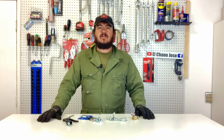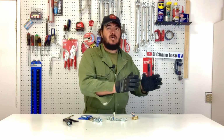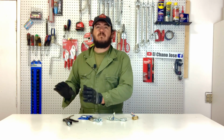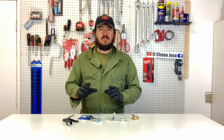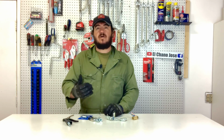And well, folks, we wanted to expose these simple tips that can make a difference when you're buying tools for your garage or for your shop, because if you keep them all automotive or all industrial, that can make a big difference. That way you're not fighting that this doesn't fit here, this doesn't fit there. So you just keep it simple, with uniform fittings. But if you're using more than 150 pounds of pressure on air, on pneumatic tools, you want to go with industrial. But if you just stay at 150 or lower pressure for your shop, automotive fittings are just fine.